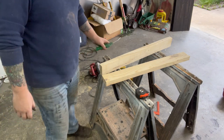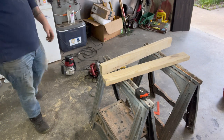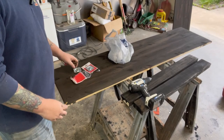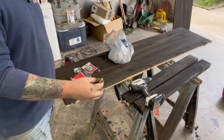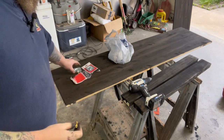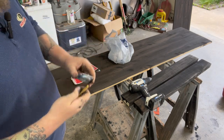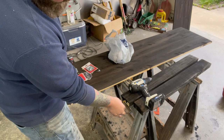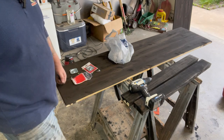I'm not a professional, like I said — I'd call this maybe 'Dick built.' I'm going to get these wiped down with some alcohol and get them stained up. I need a way to attach those to the top, but I don't want to drill holes through the top. So what I'm going to do — take a bolt here that actually fits up in here, threads right in real good. What I'm going to do is drill a hole at the top of these legs, screw that in there, then cut the top of these bolts off. That way I can just thread these legs right onto here.